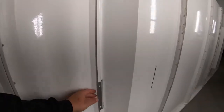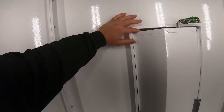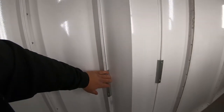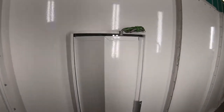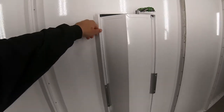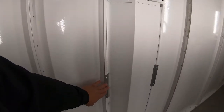I want to show you guys the light fixture install. It gives you two light clips per light and a piece of glass. You insert the glass, then the light fixture itself, then the two clips. We went centered — you could go kitty-corner but it would probably kick out the opposite ends. I'm not sure what they intend you to use to seal the light to the glass because they don't give you anything. We went to a friend's canopy shop and got some three-quarter inch foam tape, and we foam-taped the perimeter of the window opening, then laid the glass in, put the light fixture in, and mounted it with the two light clips.